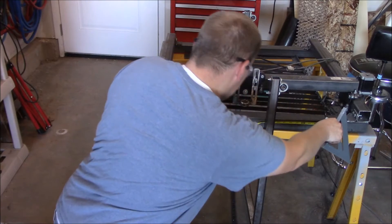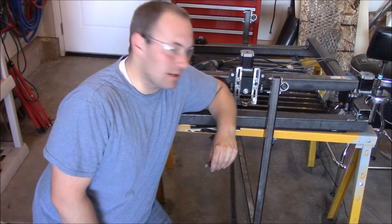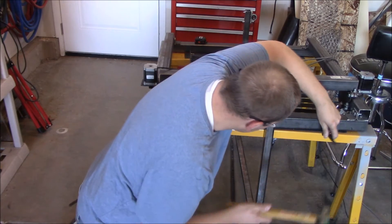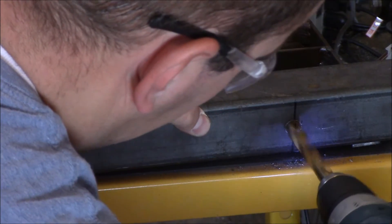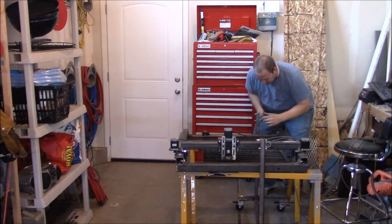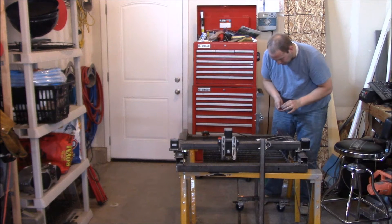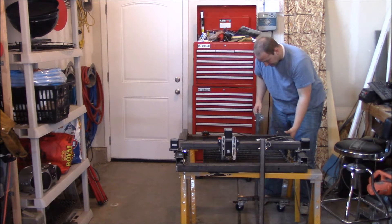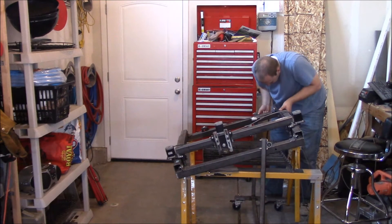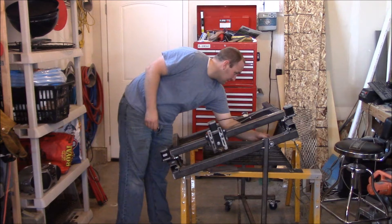When you're drilling a hole in metal, especially steel and drilling by hand, it's not a bad idea to center punch first to keep your drill from wandering off to the side. So I'll line up my center punch and give it a nice smash. To install the table, I take my 12mm bolt and slide it through the bearing. Then I'm going to hang three washers off of the bolt to act as spacers between the cart and the table. Slide the bolt through, then go ahead and install the nuts.